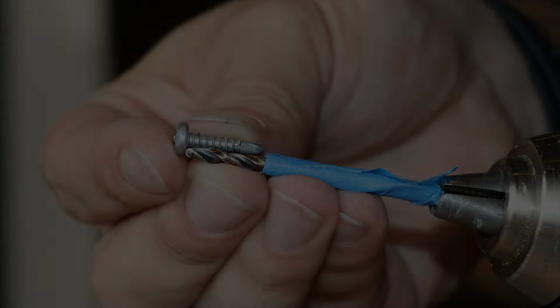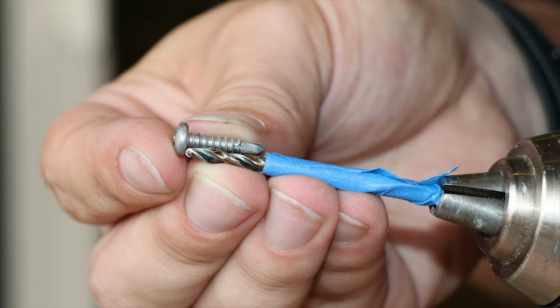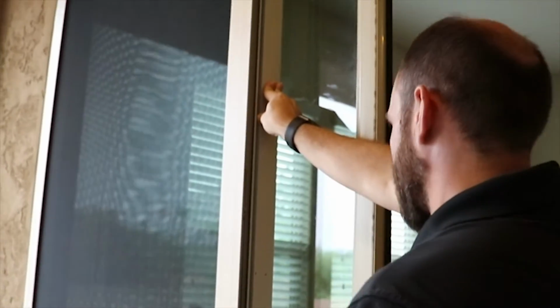In preparation for installing the interlock, mark a 1/8" drill bit with tape to indicate the length of the 5/8" self-drilling interlock mounting screws provided. Drilling too deeply into the patio door may result in cracked or broken glass. Slide the interlock into position with the oval mounting holes over the line scribed on the inactive panel vertical stile.